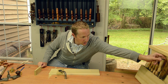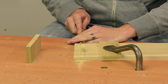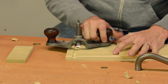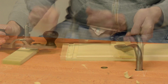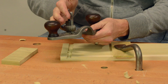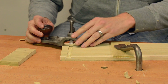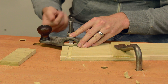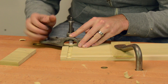I take a bench chisel that's just a little smaller than my hole and use it to knock out as much waste as I can. The fun part is using a router plane — and a router plane isn't like an electric router; it's something that cleans out the bottom of a workpiece. I loosen the back to adjust the depth adjuster wheel and set it to the depth of my line. Some of these older ones, when you tighten it, the blade lifts up a little bit, so you just tighten and lower with some trial and error. And that's perfect.